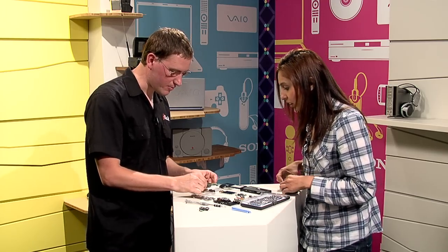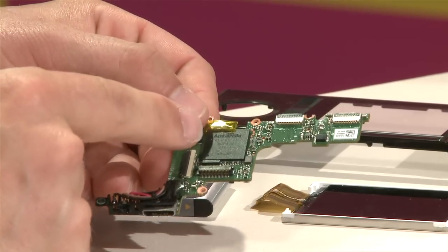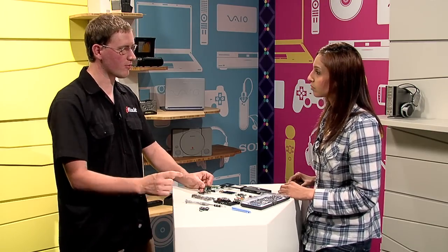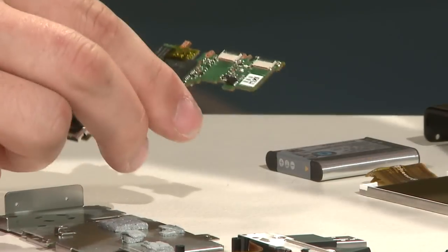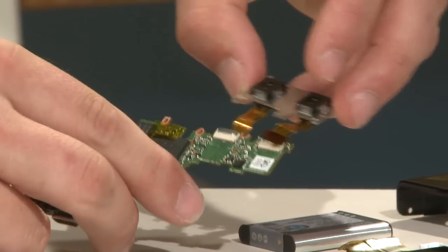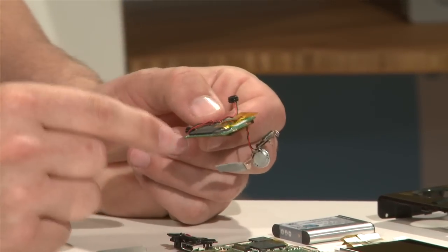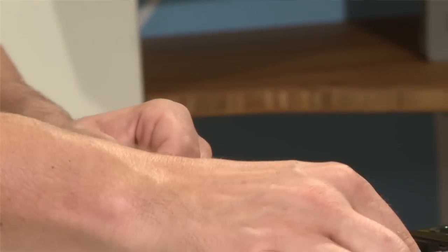We don't like headaches. So this here is the main processor — what we call a system on chip. It's basically an entire computer in one chip that's about the size of a postage stamp. And this has integrated on it a full H.264 3D video processor. So it's merging in real time the images from the two cameras and creating a single 3D frame. Then there's some various support circuitry, and you can see here is where the two cameras connect to the main board. The camera also has 8 gigabytes of memory — this is a flash memory chip, the same part you'd have inside an SD card. On this camera it doesn't have an SD card slot, so you can't upgrade it, but 8 gigabytes — with 3D taking a lot of space — still has room for 80 minutes of 3D video. So you can still take over an hour of 3D video.